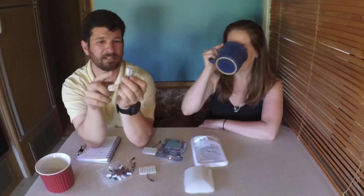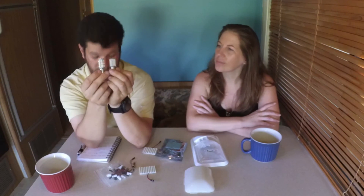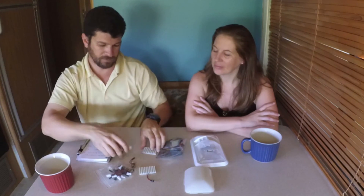As for which panels work well - this American-made one I already had, paid eight dollars on Amazon, has nice high-efficiency SMDs. The batch I ordered from China has bigger old-style LEDs on the panel but was 10 for 12 dollars versus one for eight. One important warning: these panels have exposed contacts. When turning them on and testing, make sure the leading edge of the panel is not touching metal like the light housing. If it does it can arc, and this one actually fried because it touched metal.